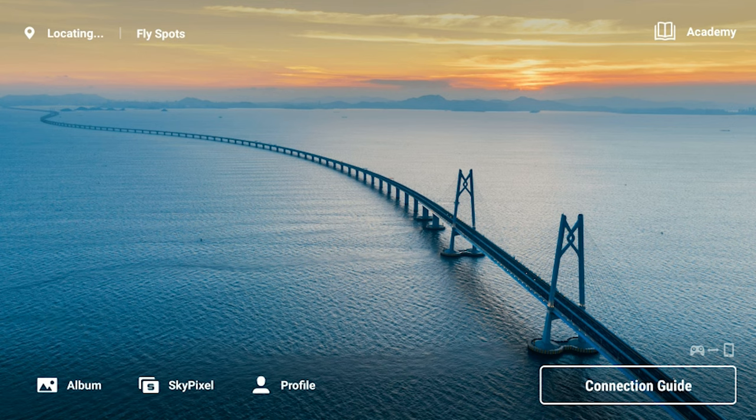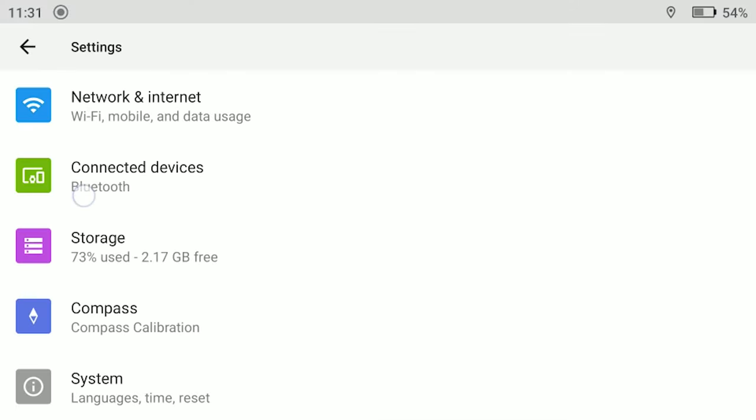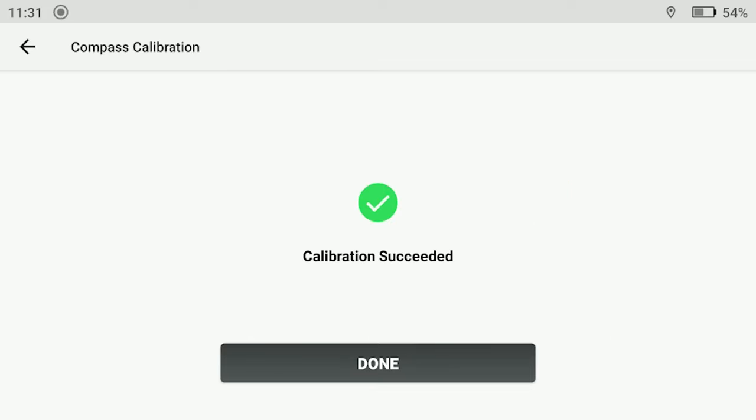The final calibration is one I'd missed for a while, so I'm sure many others had as well. On the controller settings, when you pull down from the top screen, you can see a tiny little icon in the top right-hand corner - the little hexagon icon. Click that and it will bring you to some more options where you can calibrate the compass that is built into the controller itself. If it is already calibrated, as mine is, it won't do anything when you select start, but if it isn't calibrated correctly then make sure you follow the on-screen instructions.